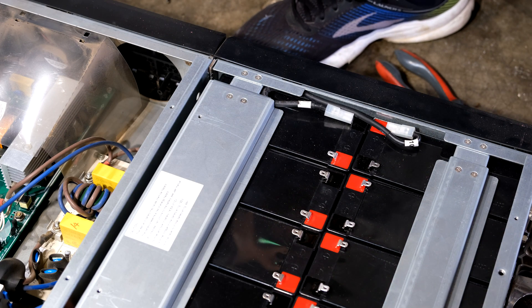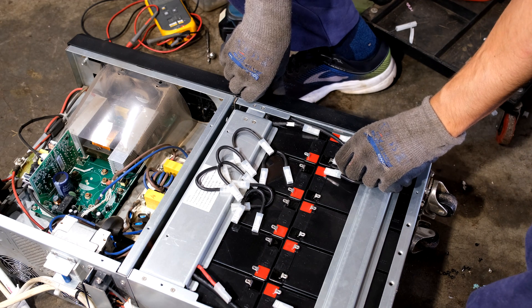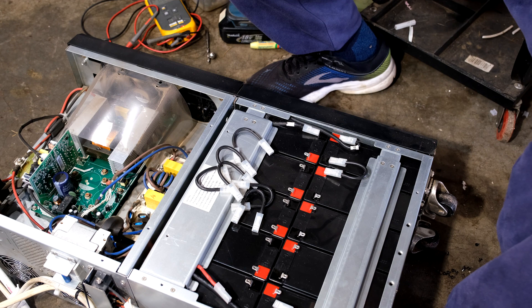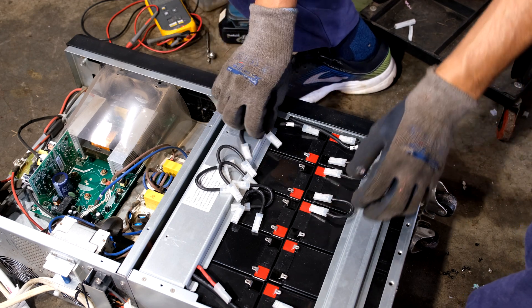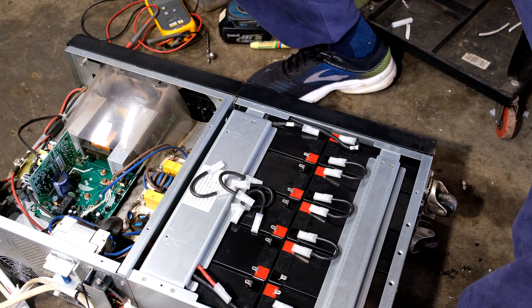The rest is easy — take your links and join all these batteries together. I'm doing the terminal compression because I'm using probably the wrong battery, but I want to test if these gel batteries are actually better since they're much cheaper. This is a cost-versus-performance evaluation. If I have to change these batteries every year I'll use the cheapest, but if they last three years I don't mind spending more. The previous batteries barely lasted two years, and lead acid batteries lose 15–25% performance per year.